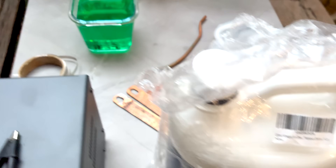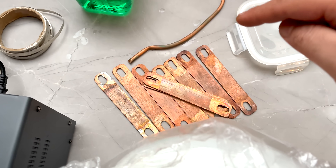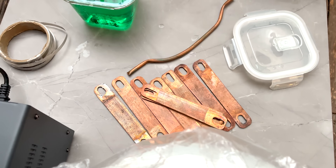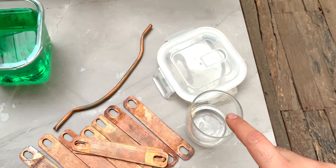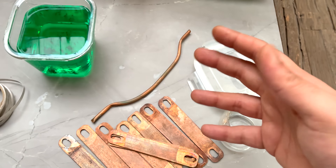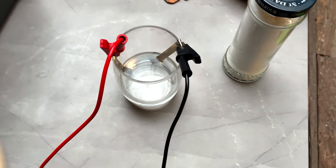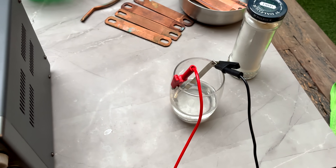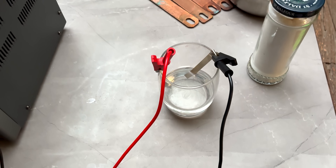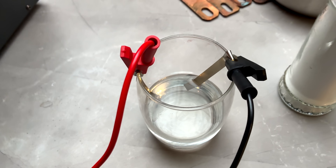To make the solution you need vinegar — I have 15% concentration vinegar, and the stronger the concentration the better. I'm going to use the same vinegar to clean up the copper and remove some of the oxidation. I'll make a small batch of the nickel plating solution in this little glass to show you how it's made, and then we'll get on to the electroplating process. Make sure you do this in a well-ventilated area with exhaust fans on, because electroplating will give off some gases.